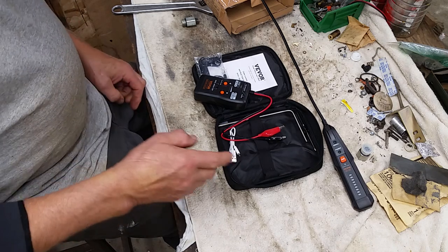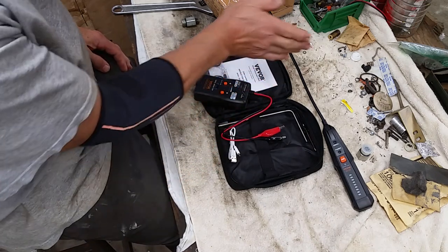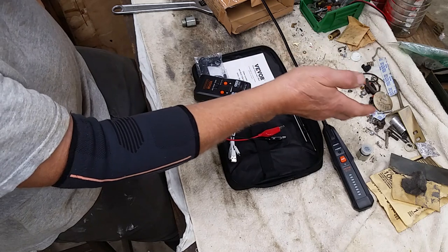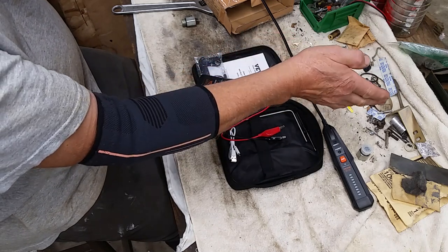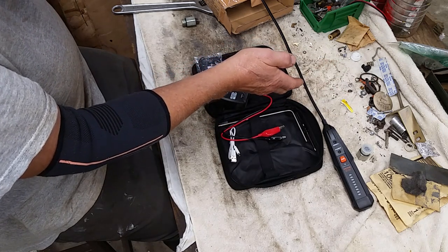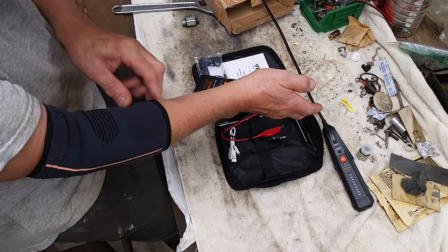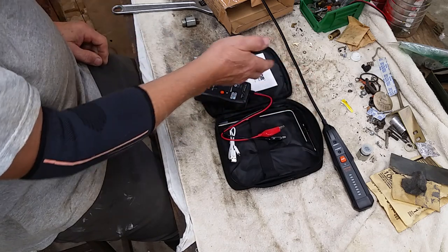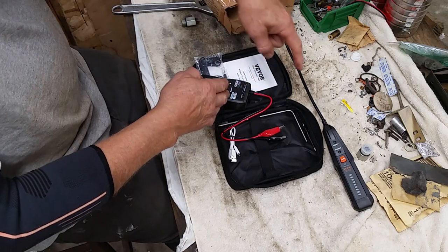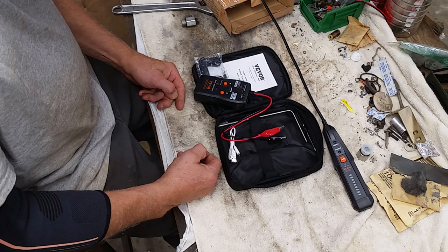I could tell my cable almost made an L. It went out from the garage out to the ledge and then took a right-hand turn. And that's because I had some construction done several years ago, so I had to extend it. And for the most part, I could tell where the cable was along the ledge because it turns out it was not to code. It was only down about 14 inches. It needed to be 2 feet. So it was close enough that it actually had a reasonable signal. And I could tell where it started taking the bend, which was critical because I didn't know how far along the ledge I could go. So although it didn't work perfectly, it worked sufficiently for what I needed.